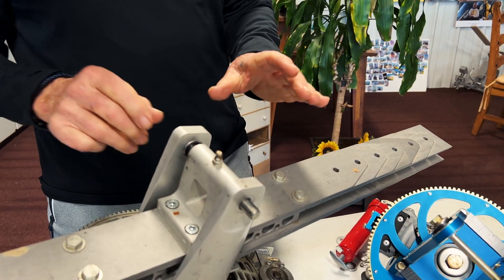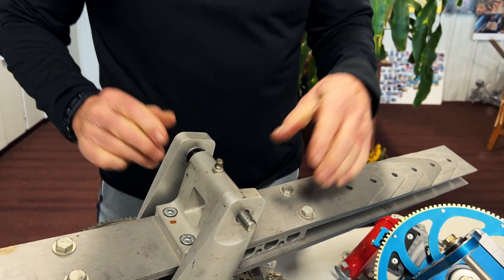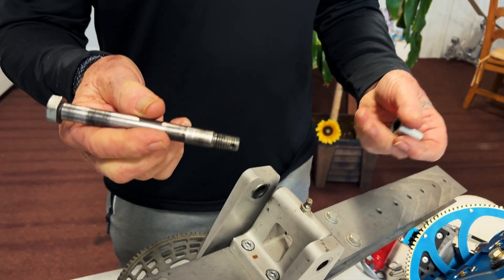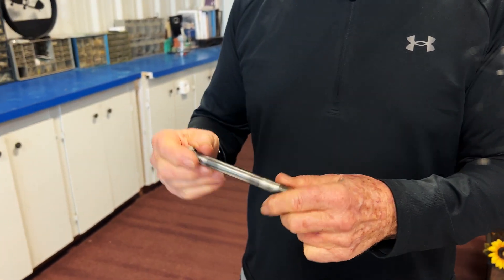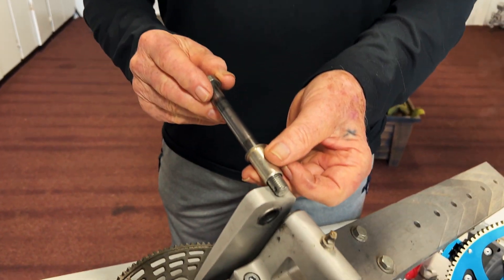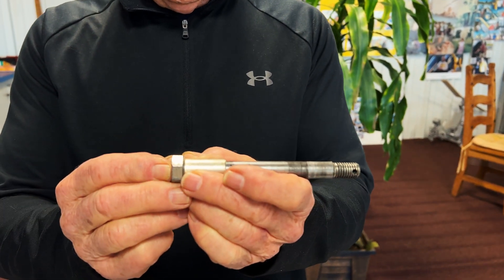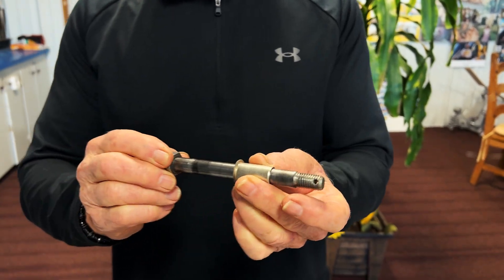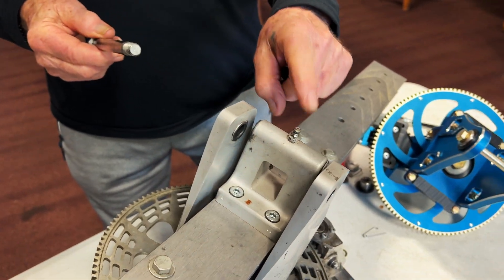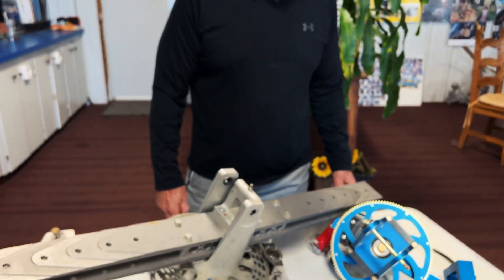Regarding the auto gyro, there are some people that recommend you take your teeter bolt bushing, grease the bolt up, and then slide it through the bushing and push the old teeter bolt out as you push the new one in. But that actually scrapes all the grease off, so in my opinion that's not really effective. It's best to, as the manufacturer prescribes, use this grease fitting here to adequately grease the bushings. I hope that's helped — thank you for watching.